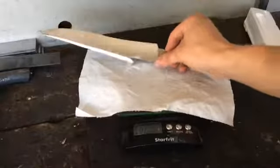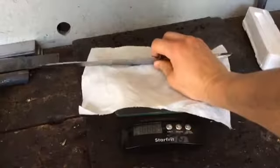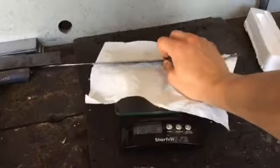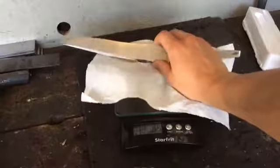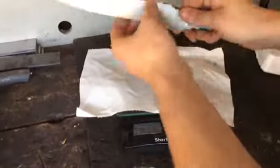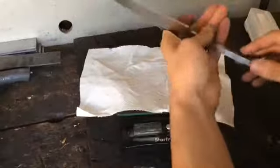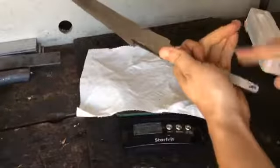and then I'll harden it. First thing I'm going to do is I'm going to normalize it, so I'll do that three times, just heat it up and let it air cool. That'll let the grains reset and get finer, sharper, and harder. It'll make the blade more tough. So I'm going to start with heating up the tang, and then we'll go for the final,